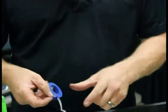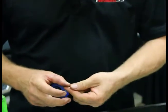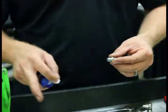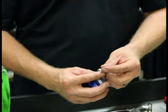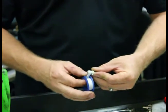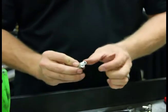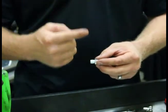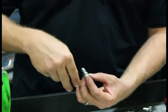Teflon is actually the lubricant. Start off with a nice straight piece. Now, it matters how you put it on — if you put it on in the other direction, as you're spinning it in it's unwinding it off. So you put the fitting in your left hand, start from the bottom like so, and then go around the top. Couple times around, break it off, and clean it. You want to make sure none of this gets in front of the middle. This way it's oriented in the direction so as you thread it on, it stays put and acts as lubricant as the male pipe thread engages with the female portion.